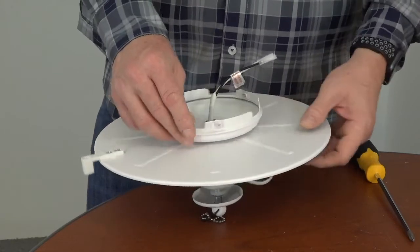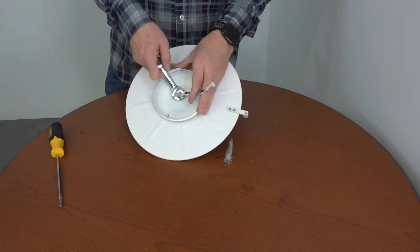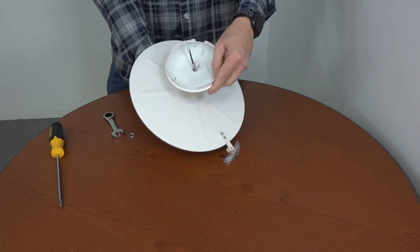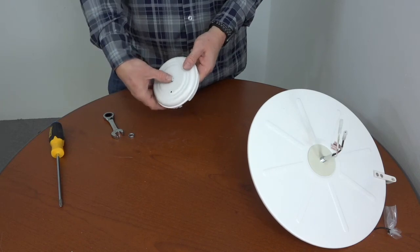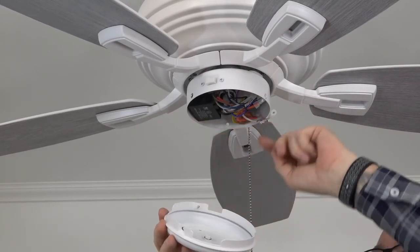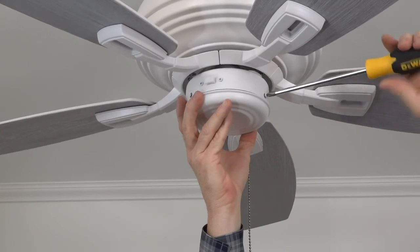To install this fan without the light kit, use a Phillips head screwdriver to remove and save the three screws in the switch cap. Then use a pair of pliers or a small wrench to loosen and remove the hex nut inside the switch cap. Turn the switch cap counterclockwise to unscrew it from the threaded post, then gently pull the light kit wires one by one through the center hole of the switch cap to remove it. Use the plastic center plug included in the hardware kit and press it into the center hole of the switch cap with your thumb. Before attaching the switch cap to the fan, note the large cutout that aligns with the reverse switch and the cutout that aligns with the pull chain. Align those notched cutouts and place the switch cap into the switch cup, adjust to align the screw holes, then secure with the three screws.